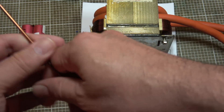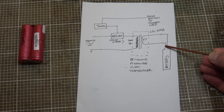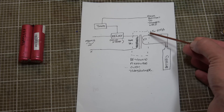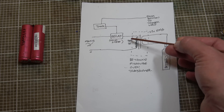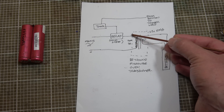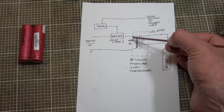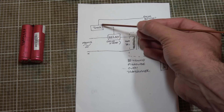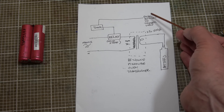I've drawn a quick diagram of what we're looking to achieve. Here's our battery with contact points, and we've got our two-turn winding on this big microwave oven transformer, giving us one to two volts at many many amps. On the mains side, I think it's a 700 watt transformer, so we're pulling around three amps from the mains. I'm going to use a solid state relay to control the mains on and off so I can do fairly tight timings, with some kind of timer controlling that solid state relay and a push button to actually trigger the welding cycle.